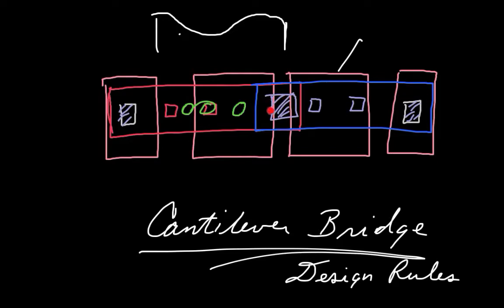This here is your via — your poly one, poly two via. So that connects this blue guy, which is your poly two, to the poly one underneath. You have to overlap that via structure: both the poly two has to overlap the via, and what you're connecting it to has to have an enclosure frame that follows certain rules — I think it's five microns. And then here are the holes for the poly two structure — that's release holes, and that would be hole two. And on this end you've got an anchor.